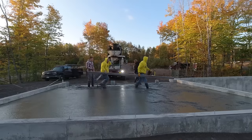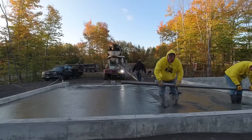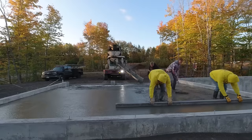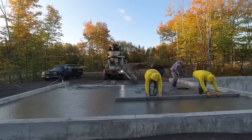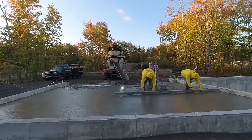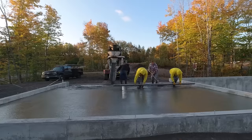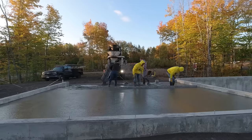You can see how that concrete is nice and flat but also sloping towards the front. It takes literally seconds to screed a bay like that. Luke in the back is still dumping some concrete — we really only need one guy raking or puddling the concrete behind us if you can get the concrete pretty close to grade as you're dumping. These bigger screeds like this are much faster with two guys kick-screeding. A 12-13 by 14 foot bay takes under a minute to screed to where you need it.